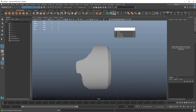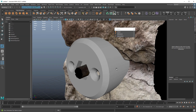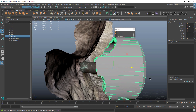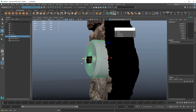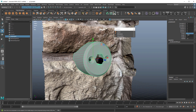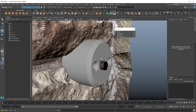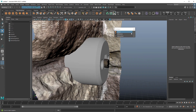To send it to the printer, it's really easy because we're working in centimeter scale, but 3D printers are usually in millimeter scale, so we need to scale it after we send it. I like to keep working in centimeters and then do the adjustment in the slicer. I use a Prusa printer and the Prusa slicer is really good, so I'm going to show you how to use that.